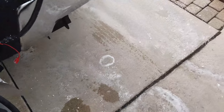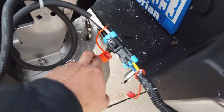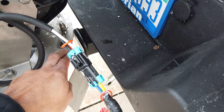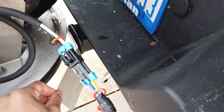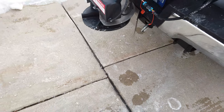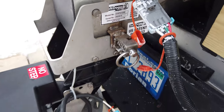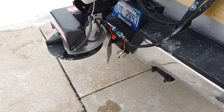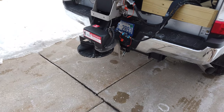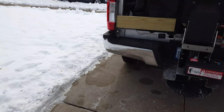The buyers supplies wing nuts that come with this salt spreader — the Salt Dog — you really got to put a tool on them and tighten them up, or else they come loose. They came loose and I almost lost this guard. I caught it in time but had to remove the guard in order to keep going, so I had to salt without it. The salt pretty much blasted the rear hitch and everything. I ended up spraying it off and could see a little bit of salt rust damage that happened pretty much immediately.